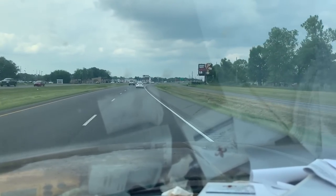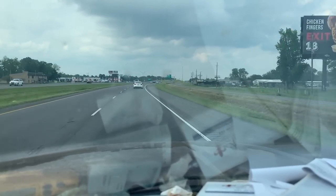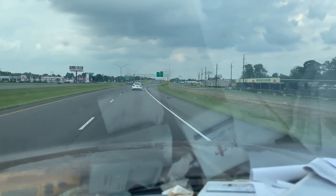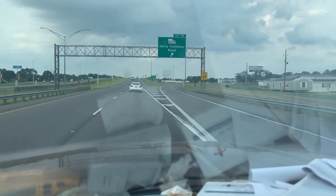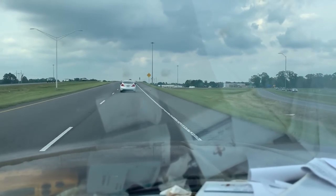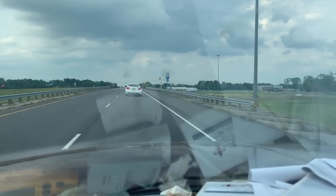and the mobile home people's AC guy couldn't get to them. They didn't know when. So they told these people to call their own AC guy and send them the receipt, and they would reimburse them. So I get out there this morning and the unit is frozen solid. So I told them that more than likely this other company left a leaking solder joint. I'd be back later today after it thawed out. I had other calls to go catch.